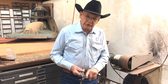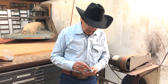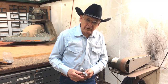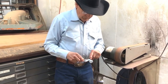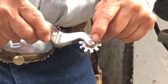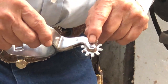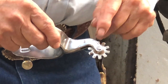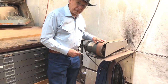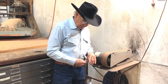If your arena is real sandy and you spend a lot of time walking in the sand, the rowels will wear out quicker too. I'm going to show you how to take the rowel out and put a new one in — you can do it at home with the tools you have. I'm going to use power tools, but you can use a file and it works the same way, just takes a little longer. On the inside of the shank there's a little head where the rivet was riveted down to hold the rowel in. We're going to grind this head off, trying not to grind any on the shank of the spur — we don't want to scratch it up. I use a belt that is fairly fine; this one's nearly worn out. I don't want a real aggressive belt or you'll be into the spur shank in no time.